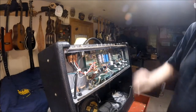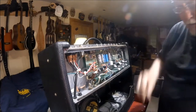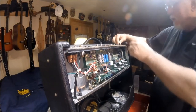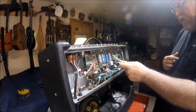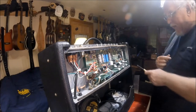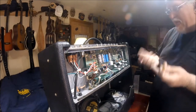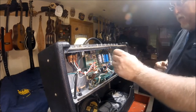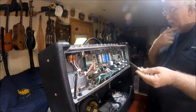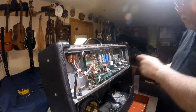There are really two different things to know about them. Let's start with the capacitors. The capacitors that you need to replace in your amp every so often are these guys right here — these are the electrolytic caps. After about 10 or 15 years they will go bad. They will tend to start to leak. Not all of them and not every time, but if you want your amp to be dependable, you've really got to replace them.